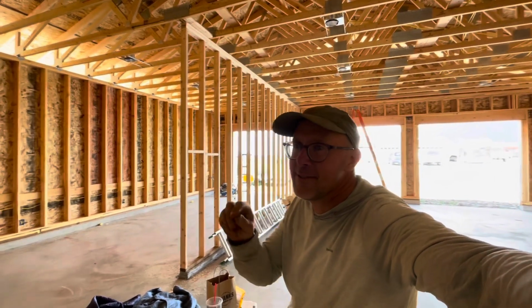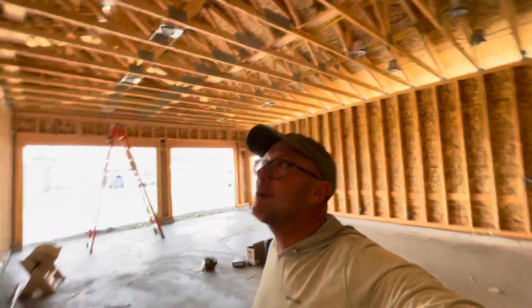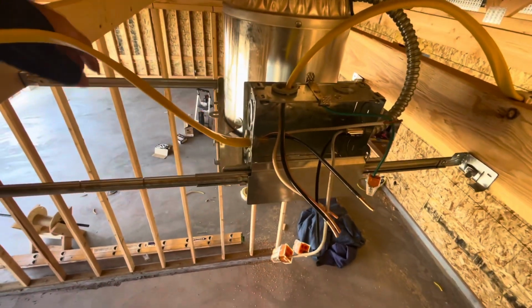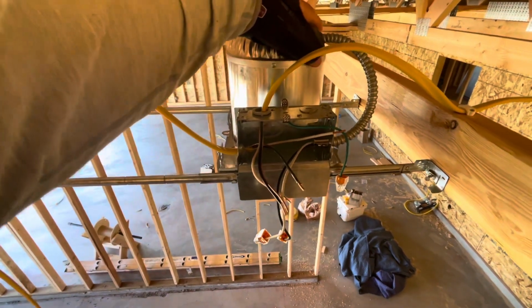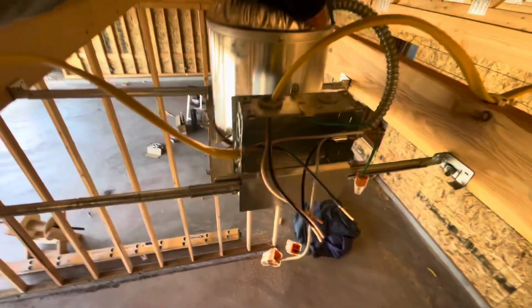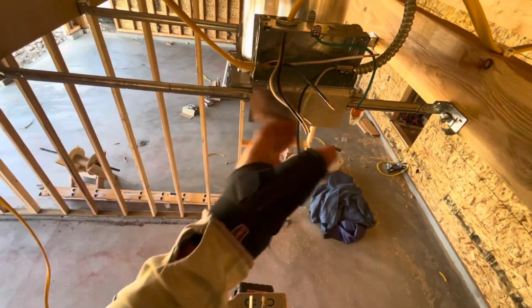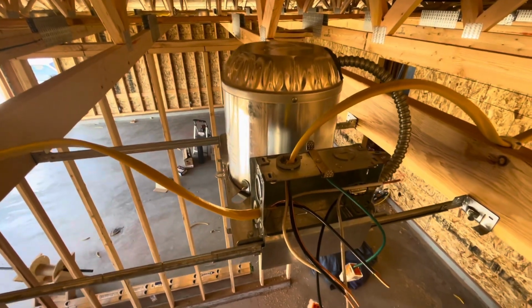I am not looking forward to the finish electrical work in each of those outlets, just doing this. It's a bugger wrestling with these 12-2 wires. One thing I will say is the longer I work with these, I'm starting to not mind them as much. It would be easier with 14 gauge wire, but that screw assembly that supposedly locks it does enough of a job. And I've been tacking these in such a way that they kind of lock it. With these heavier gauge wires in place and that screw, it really does seem to be mostly in place. It does still feel flimsy. These quick connectors are really slick. So not too bad, not as bad as I was first saying.